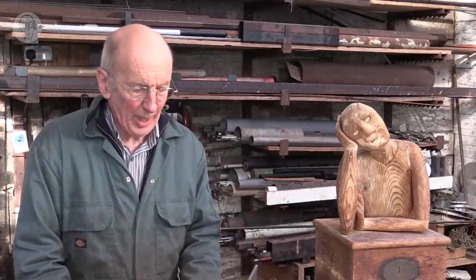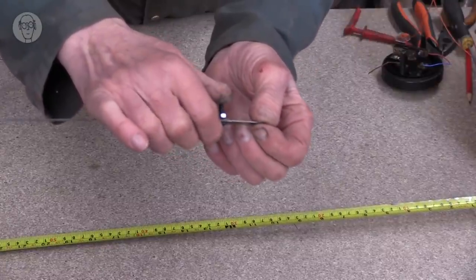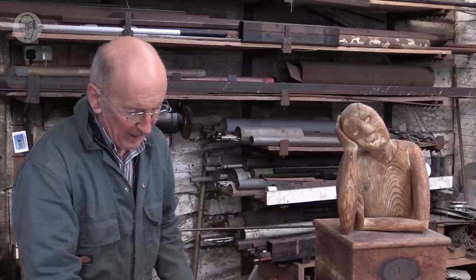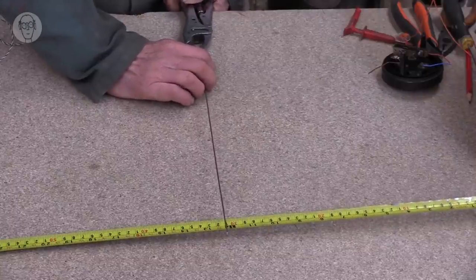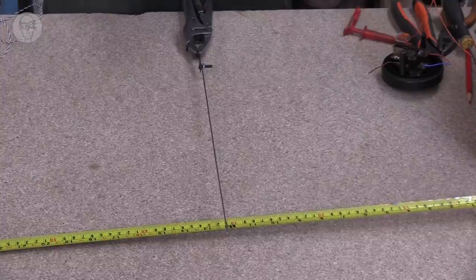So for temperature, bimetallic strips are still widely used, though they're much, much smaller than the one that I made. And they use a special alloy that hardly expands at all, so the differential expansion is bigger than between brass and steel. So if I clamp mine here and heat it up with a heat gun, the movement should be quite noticeable.